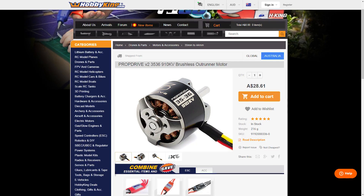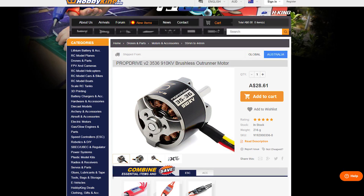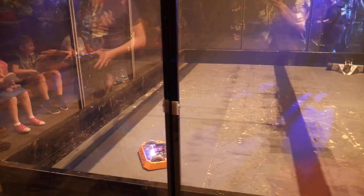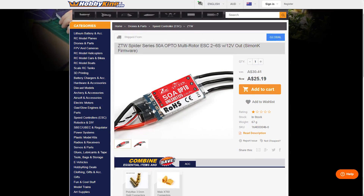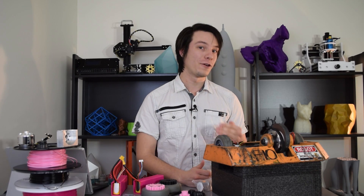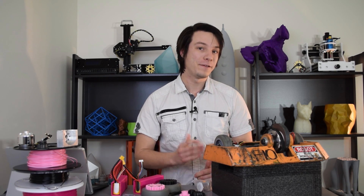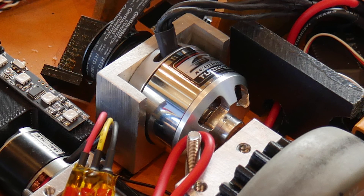Attached to the gearboxes, I used NTM Brushless Outrunners sourced from Hobby King, which are good quality and not too pricey. Sensorless brushless motor control has come a very long way over the last few years thanks to the huge popularity of quadcopters, which means I can control the motors so precisely there's almost no forward and reverse delay, using SimonK firmware running on ZTW 50A electronic speed controllers. To flash them, you need the correct firmware and a programmer. For my weapon motor, I went with a 5045 size Outrunner and a cheap 50 amp speed controller, and I would probably change this to an Inrunner next time because it doesn't spin quite as fast as I'd like at the 18 volts I'm running this machine on.